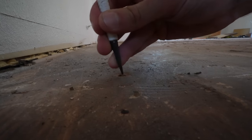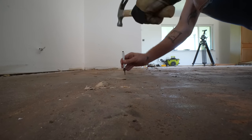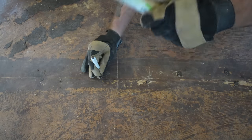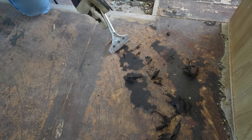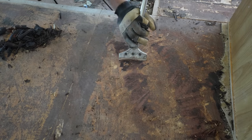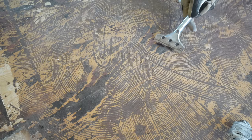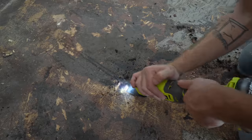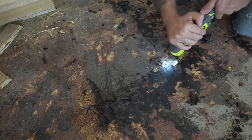There were a bunch of nails in this subfloor that needed to be set just a little bit so that everything was flat. I used a punch and my hammer to take care of that. Now that tools could run smoothly across the surface and joints, I grabbed my razor blade scraper, which came in handy big time here. Even though it wasn't the most useful hand tool for prying up the floors, it was by far the most useful tool for removing any leftover adhesive. In the middle of the kitchen, there were a couple of big blobs of adhesive that I used the oscillating multi-tool and the reciprocating saw with a scraper attachment to take care of. This took down all of our high points and it's smooth enough now that we can put down underlayment and our luxury vinyl plank flooring.